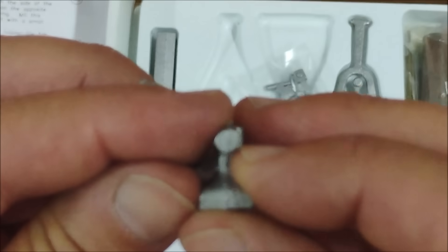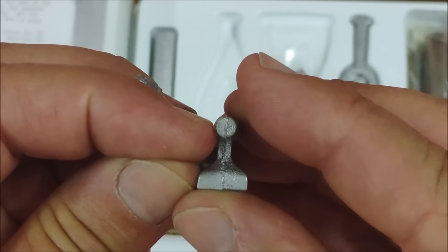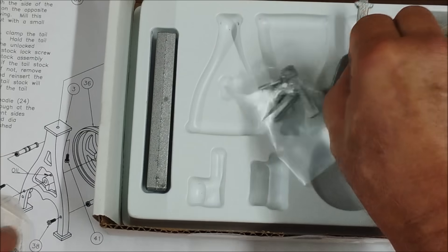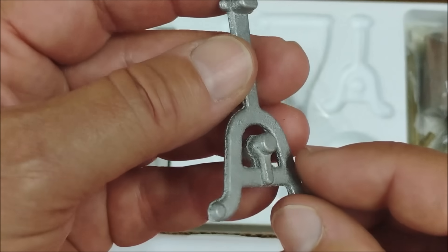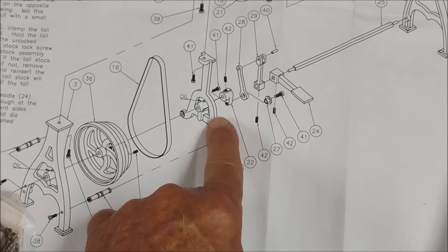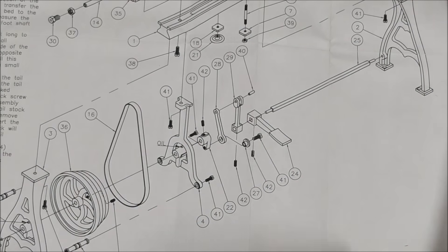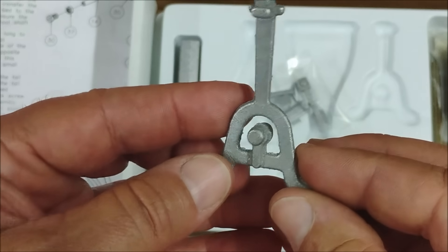Once again, nice and clean. A little bit of a mismatch — you can see that the side where my finger is moving, left side of the screen, is a little bit lower than the one on the right. So we'll be cleaning that up and make that look round, if at all possible. This is the midway support under the table. I guess this is where the brake lever comes into play — this guy down here. And that's what this pedal would be: either the drive or the brake. So as you engage it, you step down on it, you apply tension to the pulley, and instead of it slipping while the overhead belts from the shop are driving it, it engages — off it goes.